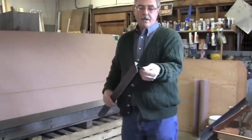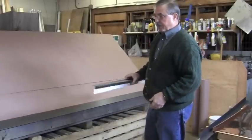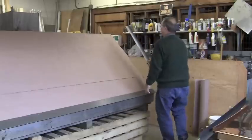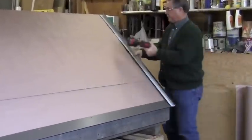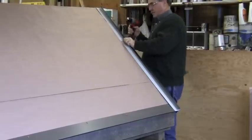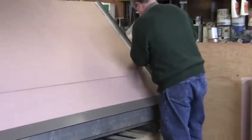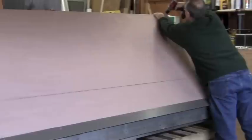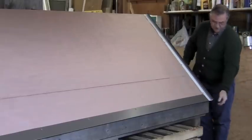At this point I have a trim — it's popular as a gable trim, a gable finish, and it's a number 15 drip edge. We made this in another color again so that it's fairly obvious. I'm going to apply this to this pent roof and then we'll show you why this panel needed an extra leg bent on that one side. Beautiful — number 15 drip edge.